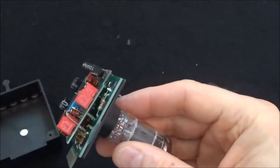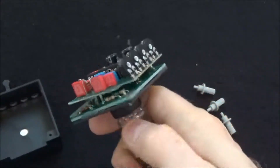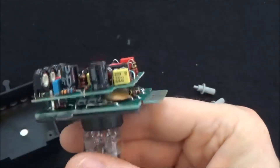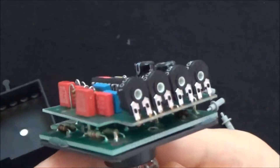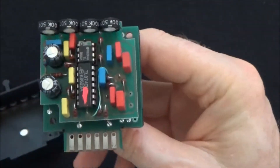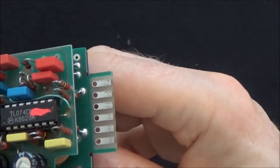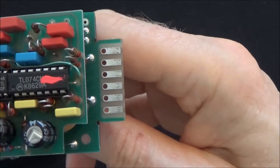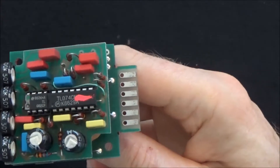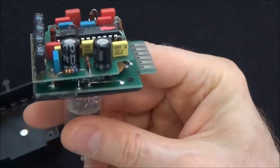You have a main circuit board with a daughter board on top of it, which is the active EQ. You can see they're kind of soldered on there in four places with these little posts. Right here you're looking at the active EQ section. They used a TL074 quad op amp and a TL082 dual op amp — so basically six op amp stages going on in here. I thought it was pretty clever engineering to squeeze all that stuff into this little module.